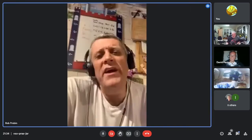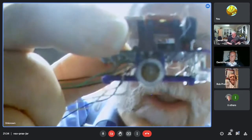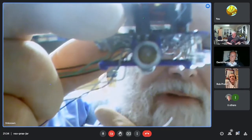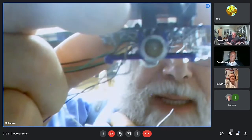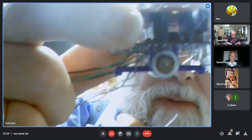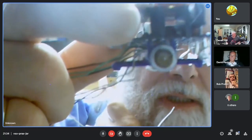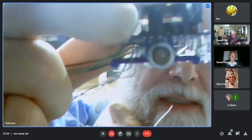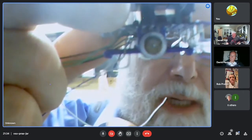What do you use for wheels again? Have we seen these wheels before? Right, these wheels, the wheels are the weak point. These are lasered out of 3mm MDF with an O-ring glued on. They're not really good enough. I'd have to probably make about 10 of them to get 2 I could use. So what I'm actually going to do is turn some up on the lathe, which isn't really a very practical solution for general people. But I've got an idea about how to make wheels, which might be next year's talk.